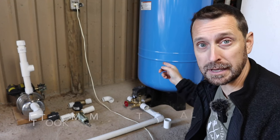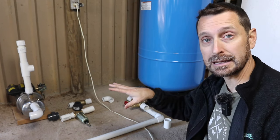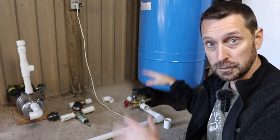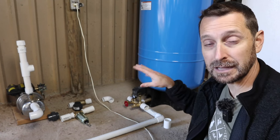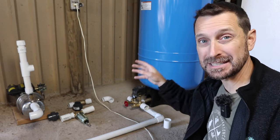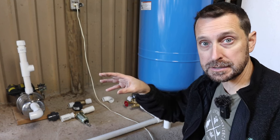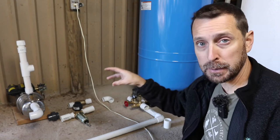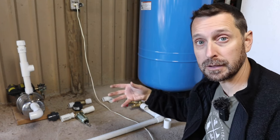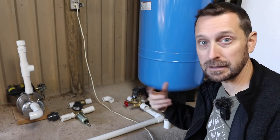I finally found a pressure tank. I had to go about 45 miles for it, but here it is and I'm super happy to have it. Now I am dry fitting and designing all of the components for the jet pump and the pressure tank in their new configuration. The reason to add a pressure tank with the jet pump is to take a lot of the workload off the jet pump. If I'm out there watering and irrigating with the rainwater system without the pressure tank, this pump would be constantly running, which is not good for its longevity. Having a pressure tank along with it is going to help save it.